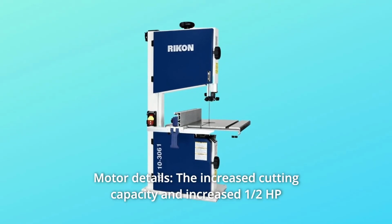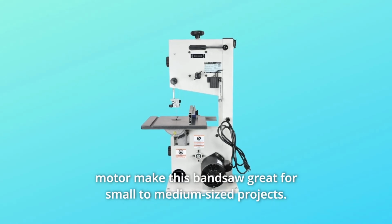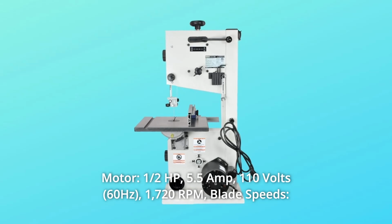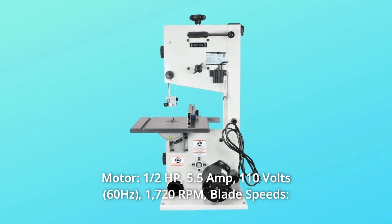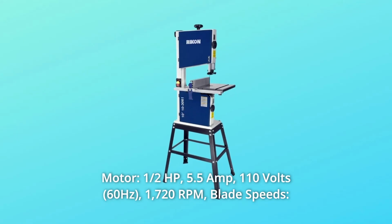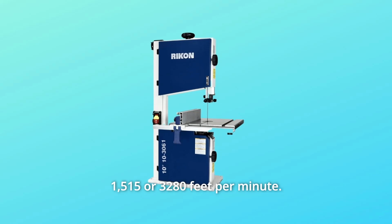Number 2. Motor details. The increased cutting capacity and increased half HP motor make this bandsaw great for small to medium-sized projects. Motor, half HP, 5.5 amp, 110 volts, 1720 RPM. Blade speeds, 1515 or 3280 feet per minute.